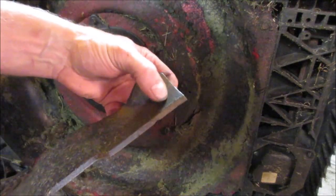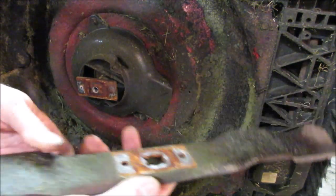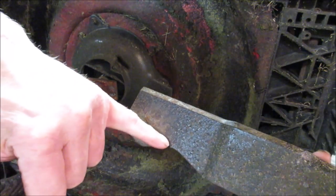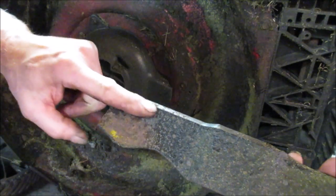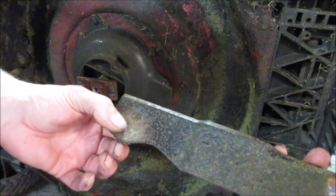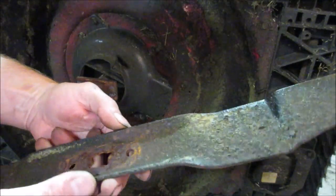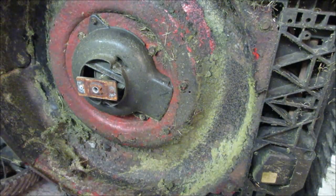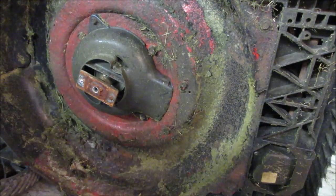You can see that blade isn't bad at all — it's actually very good. It's got corrosion but it's still thick, no damage. A lot of times you'll see a crack forming right on these little lift plates — they'll start burning down and wearing away, then you'll start getting a crack, and then this will fling a chunk of metal at you at 10,000 miles an hour. We'll go on the belt grinder and take care of that, then dig in a little more to get this cover off and take a quick look at that belt.